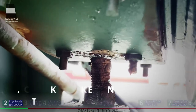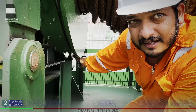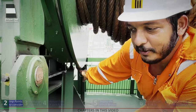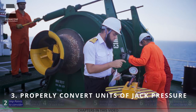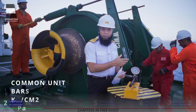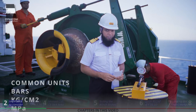Apart from the brake lining, you also have to check the brake band resting point. If the distance between the top of the bolt and the brake band is not sufficient, consult your maker's manual and adjust either the bolt or the brake band lining as required. Also make sure you have converted the jack pressure values in form F16.10 to match the actual pressure units on your pressure gauge — some gauges measure in bars, some in kilogram per centimeter square, and some in MPa — so this conversion is necessary.